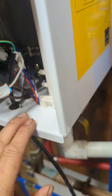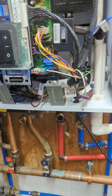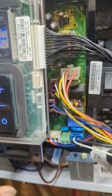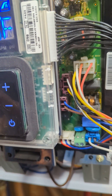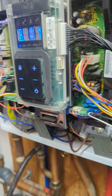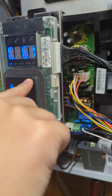We pressure tested it, turned on the power, and we have 14.9 PSI in the system. PJ is going to turn on the water heater. We set it to shower mode, go to info, press plus, and look for the letter E — it will say gallons per minute flow.